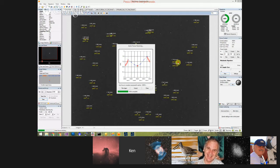With the backlash compensation, we usually just recommend doubling what seems to work. There's not really a lot of bad effects to having more backlash compensation than you need. There's certainly some bad effects if you don't have enough, though. Yeah, I agree with that. It wasn't until I boosted it way up that I had success with it. Much, much higher than I would have expected. I think maybe 400, or something like that. No, I think 200, but whatever it was, I have big steps.